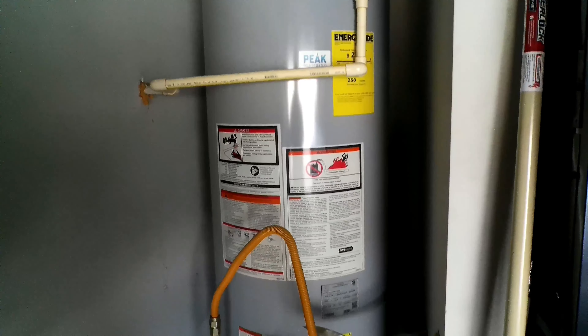In total it took about 15 minutes for me to completely flush the water heater. This next step is important: open the cold water main for a few seconds, then turn it back off and allow the water to drain. Repeat this process two or three times. Doing this allows water to rush down toward the bottom of the water heater, washing away any remaining sediments.